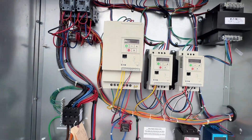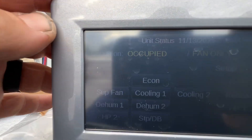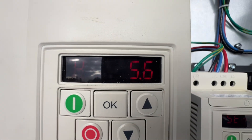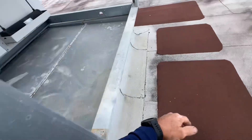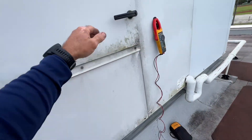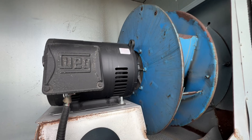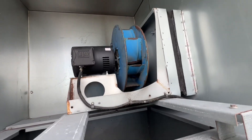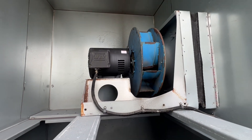It's getting ready to start here. Alright, she just clicked — that's our supply fan. Let's take a look over here. Came over here to check the motor out — this is what you hear. Looks like it's trying... it's definitely seized.